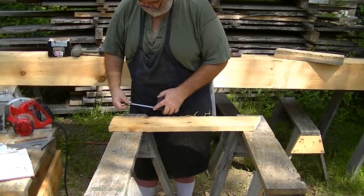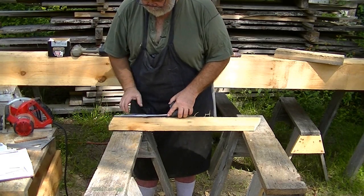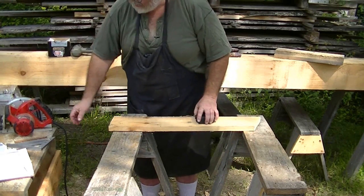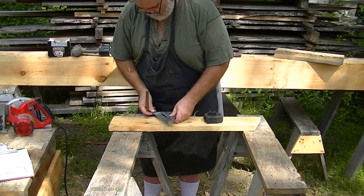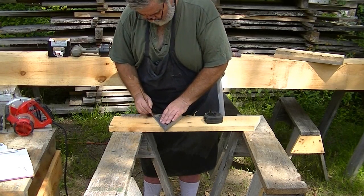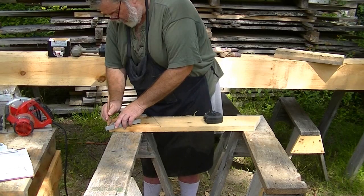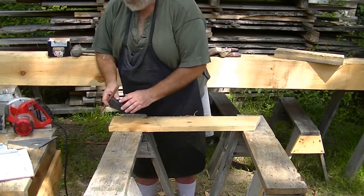To lay out the gusset, it's 6 inches across the top to match the 6-inch cap board, and 10 inches across the bottom to get a nice angle. I don't know what the angle is and I don't care what the angle is, but I've drawn a center line on my board. From that center line I've measured over 3 inches and I draw a line diagonal and another line diagonal. So the bottom of the gusset is 10 inches wide and the top is 6 inches wide. This will be my pattern.